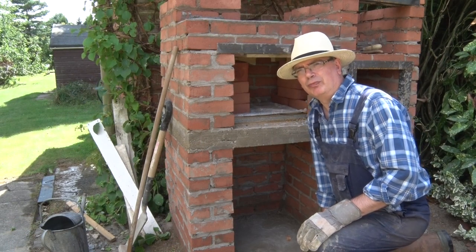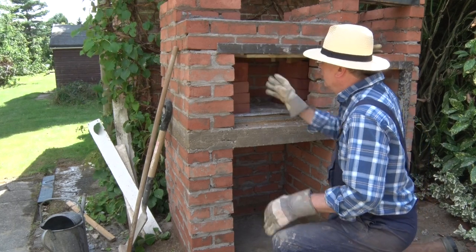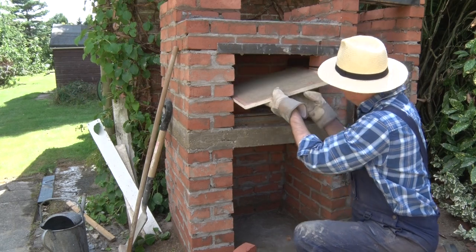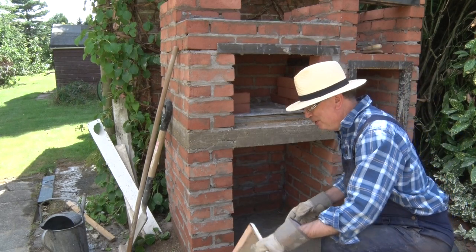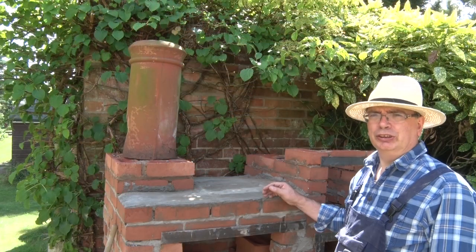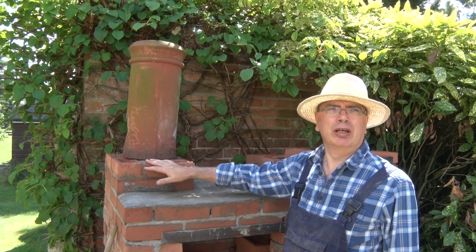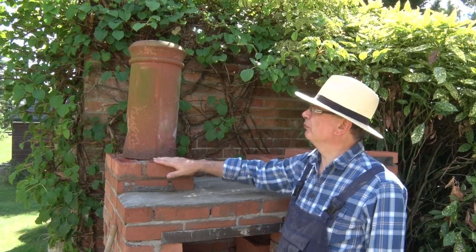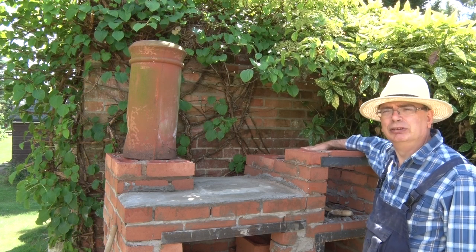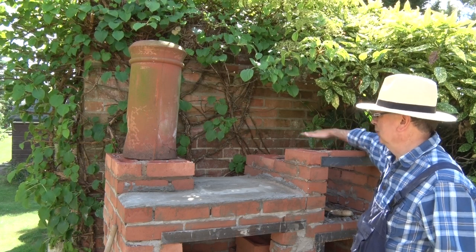Well here we are at the start of another new day. It's the moment of truth — this has dried overnight so let's see what happens when we take our wooden wedges out. It's stayed in place. You have no idea how good that feels, but if you try building one for yourself you'll find out. As you can see at the top here I managed to find myself an old chimney pot — I'm going to use that on the top of the chimney. I've still got to take this up another couple of courses because the top of the chimney pot has to be above any nearby buildings. Here which is the top of the proving oven, I'm now ready to start casting the slab. I've got one more course of bricks to go in around the edge and a couple of bits of steel reinforcing rod, and then that will be finished.